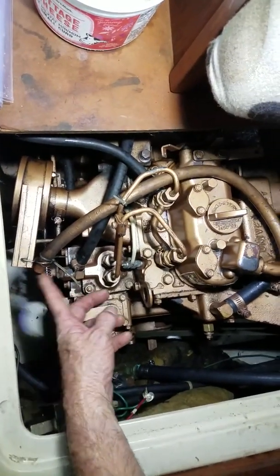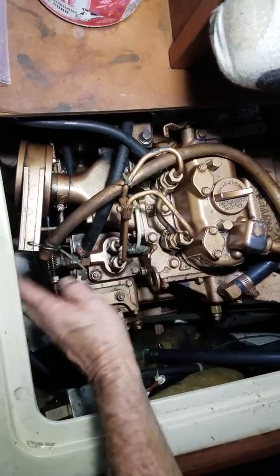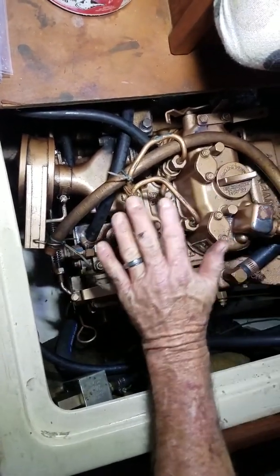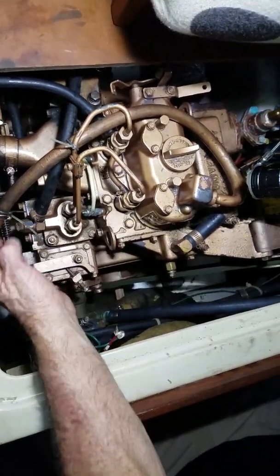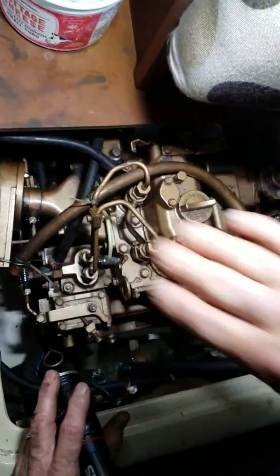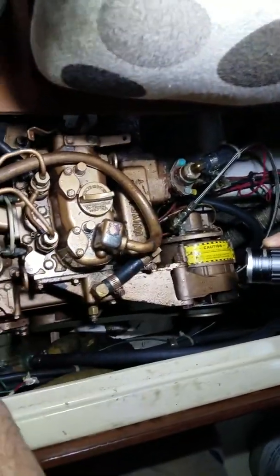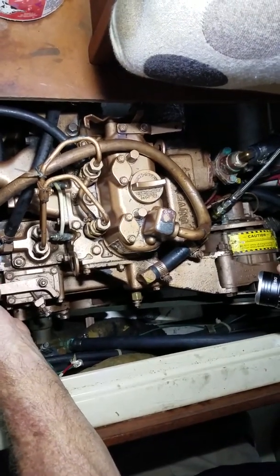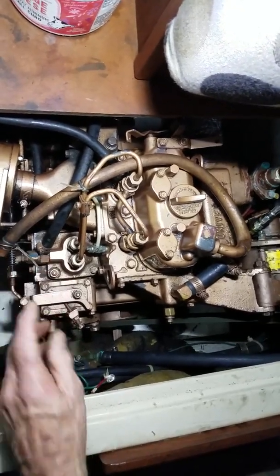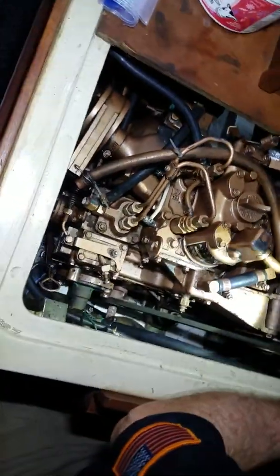Right here, burned in the engine because this will have an oil mist and smoke. Not a lot, but that is why it's tied to this — it allows fumes coming out of here. There's a little bit of pressure because of blow-by pressure, which isn't a lot, and then this is under suction going back into the engine. It burns it. Some of these go into the manifold; there's all kinds of arrangements. Don't freak out if you see smoke — it's not billowing smoke.